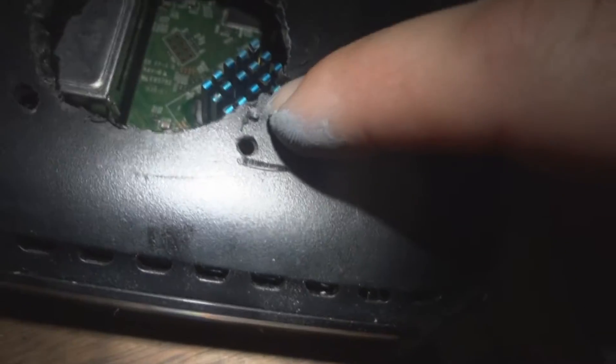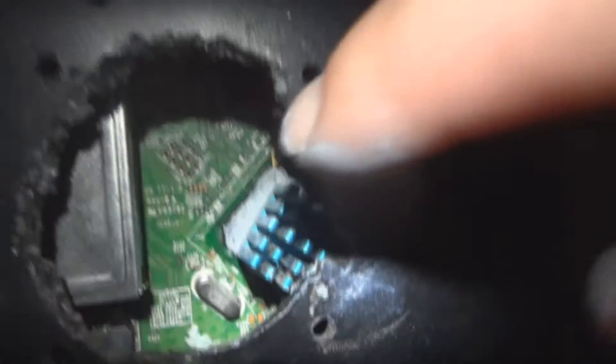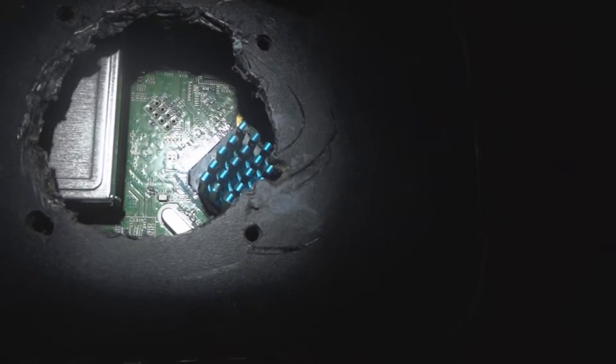The copper wire holds the heat sink, but since it's under the plastic cover, that also pushes down the heat sink onto the chip a little bit. You want some force on it, but not too much that you crush the chip. It's not the same size as the chip, but I've tested it and it works really good. The fan blows in and keeps everything cool — this thing gets really hot without it.